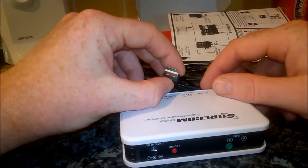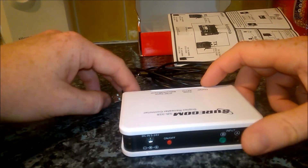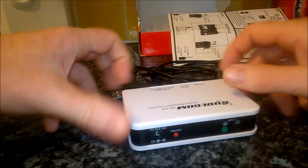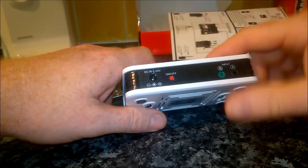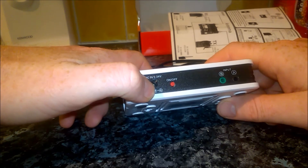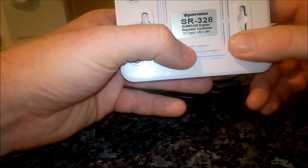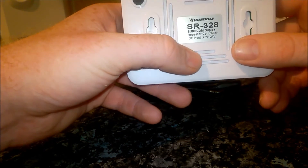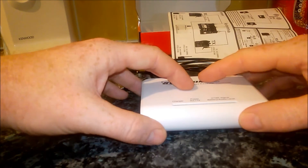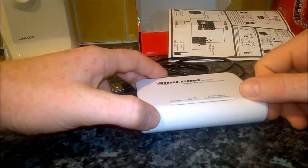The built-in battery is 3.7 volts, but the external power input on the back is rated 5 to 24 volts. It runs off 5 volts via USB — you get about three days from the built-in battery — but it also supports 12 volt and 24 volt systems. I wouldn't put more than two or three amps through it, and obviously fuse it appropriately.